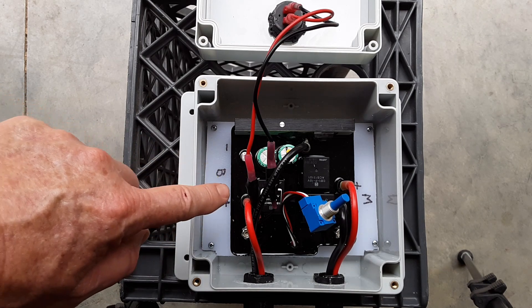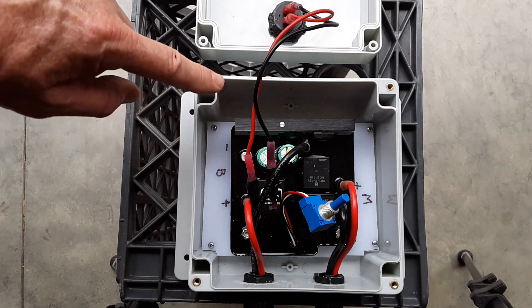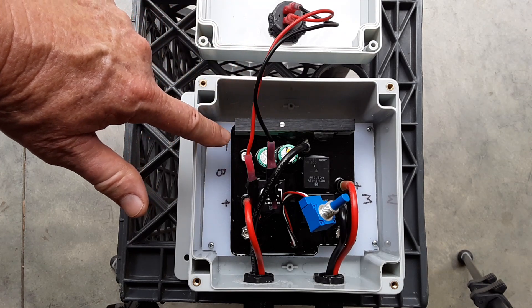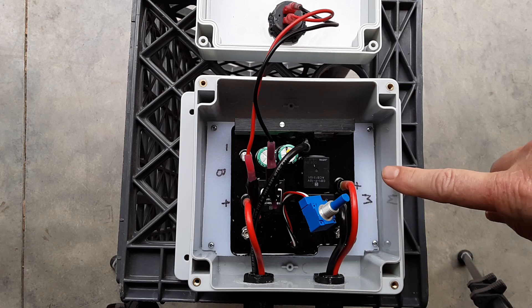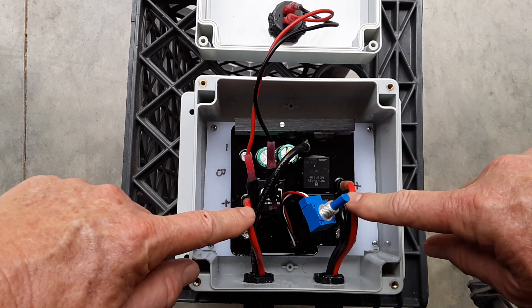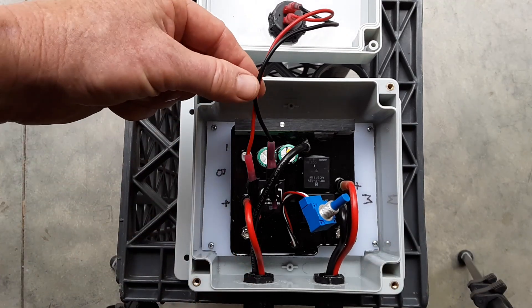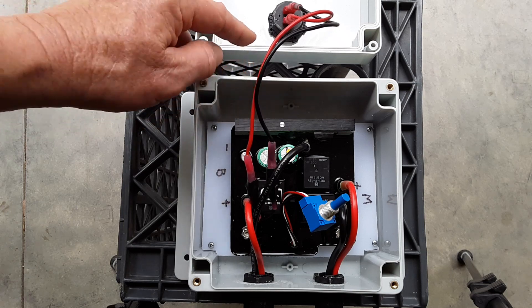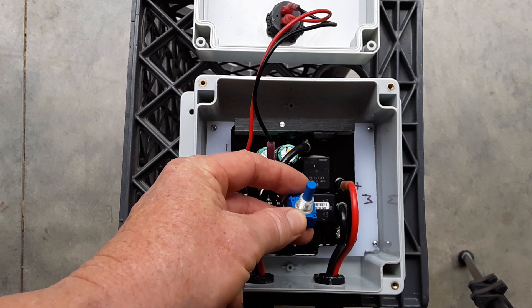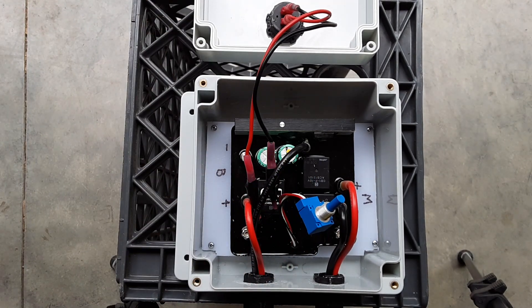I have my electrical connections marked. On this side it's the battery with the plus terminal here, and the minus is on this side. On the other side I have the motor connections, plus and minus. All four of these wires, which are 10 gauge, go out through the gland nuts. I also made my splice here for the voltmeter that goes through the top of the lid, and this is the potentiometer or speed dial, which connects through the other hole I drilled through the lid.